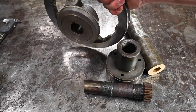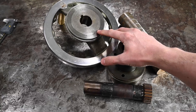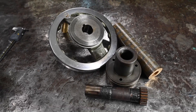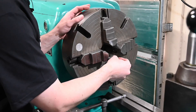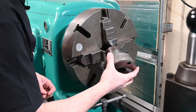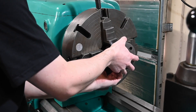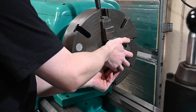Once it's pressed in, we'll bore this to match our 1-3/8" with some clearance to match this shaft. The last op will be to clean up that face on the back of the hand wheel, which has also been worn against this. So that's our plan - we'll see what surprises happen along the way. Fortunately the four-jaw chuck was already in the lathe. We're going to put our little copper pads here to prevent marring up the surface. It probably makes more sense to put this piece all the way up against the top of the jaws.